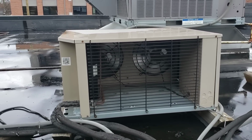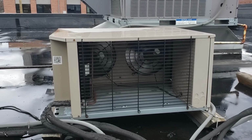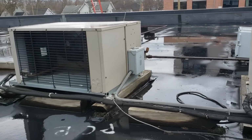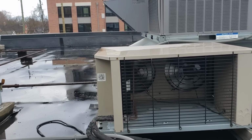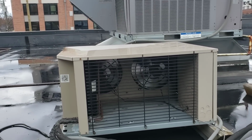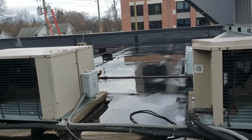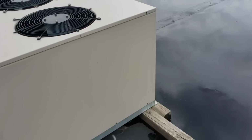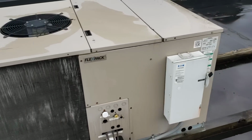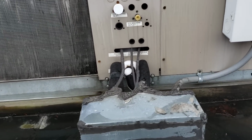Usually this location they have like open air cases, so it's probably some sort of display case. Compressor will be down at the bottom, and of course we got the condenser up top. Same with that unit there. But like I said, I've never seen Bohn or Heatcraft units like this, so I walked by and I was like, somebody stole the compressors out of these. But no, that's not the case at all. So I think over here in our Bohn flex pack, which I've never seen one of these either, we got a little sticker that says cooler out.